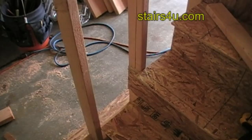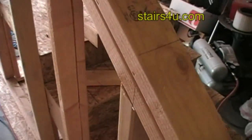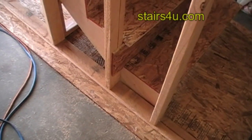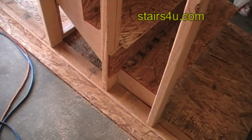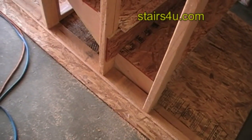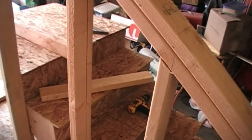A little bit of planning can go a long way. If you're in a situation where you have a freestanding handrail like this and you have an opportunity to put something in the concrete, do it. Or if this was sitting on top of a subfloor, you could always cut a hole in the plywood and put a post in there — anything to give yourself some additional support.